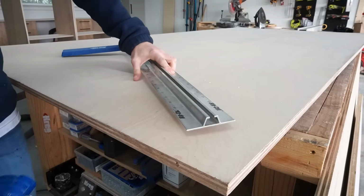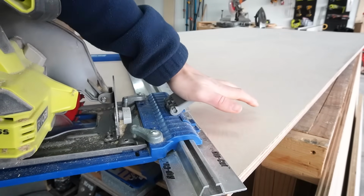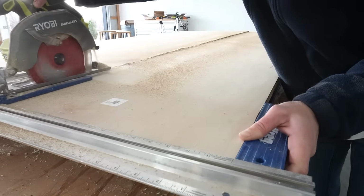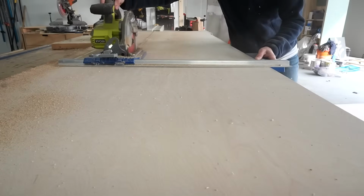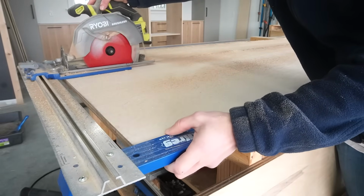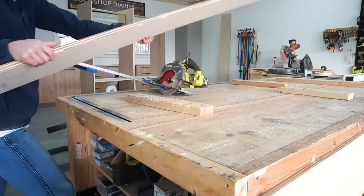Then I started building. I built everything here using cabinet grade plywood. I had to use a combination of birch and maple since my store ran out of birch, and I switched over to maple mid-project. I used my circular saw and Kreg Ripcut to start making my cuts. I'll link a guide for how I cut down full sheets in the description below. This closet consisted of 5 main parts. I built everything in the shop separately and then carried them all inside to install them.